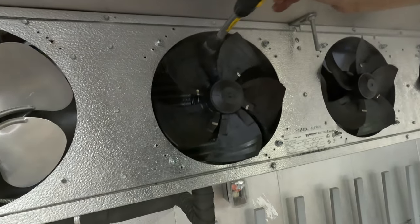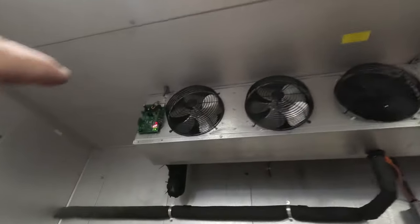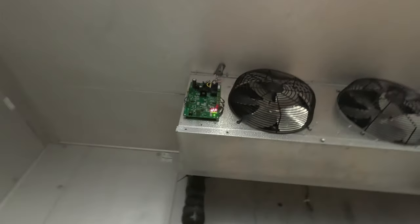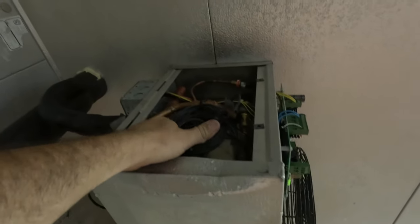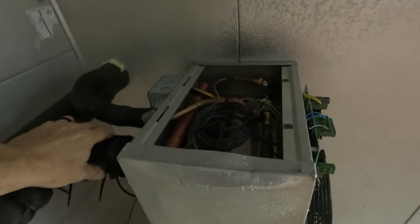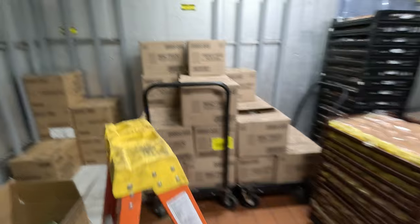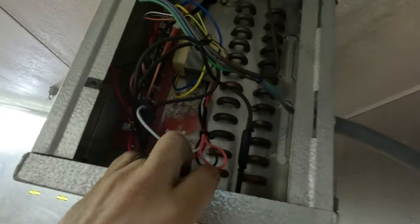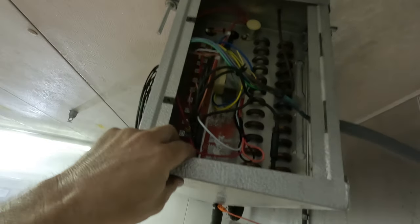None of it's getting in the motor so we're good. We got it all down but I don't know why it hasn't kicked out yet — it still shows 71 degrees. You can definitely feel the hot gas coming through on that suction line now. We got that wire-tied so nothing can drip onto the transformer. I still think that's a horrible place for it.